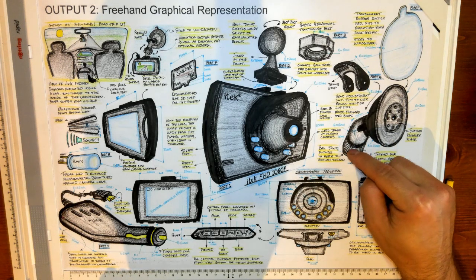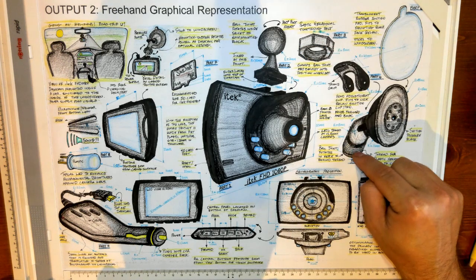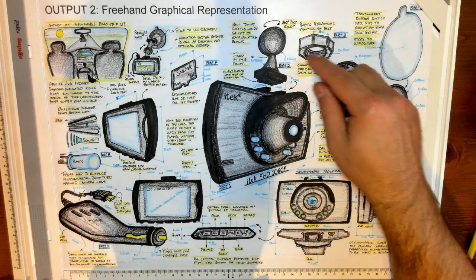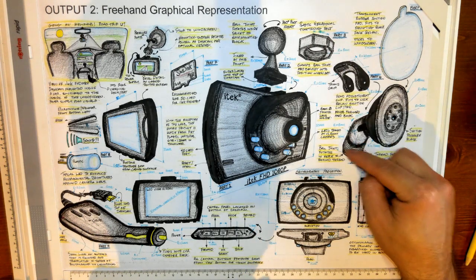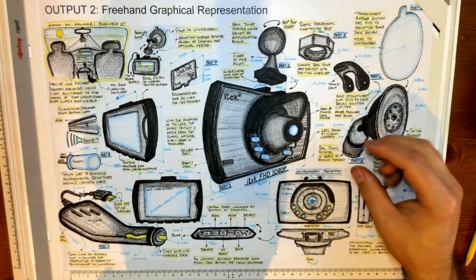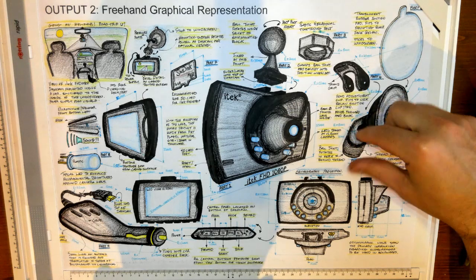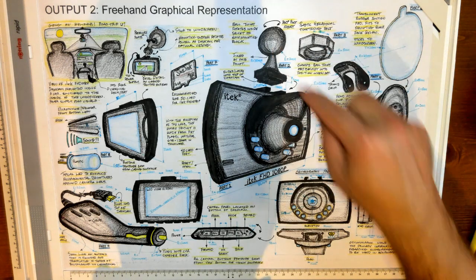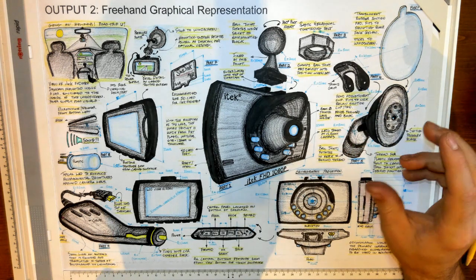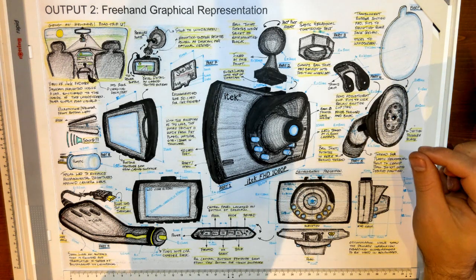You can see the thread here — what role does it play? Well, this bolt that I've drawn out actually spins onto this thread. When you move the socket and ball, you loosen the thread on the bolt until the bolt moves up. It's a plastic hexagonal tightening bolt. When you move that up, it releases the pressure on the plastic, allowing you to move the ball more freely inside. As you twist it back around, it tightens the plastic around the ball and locks the ball and socket joint in position. Once you have a set position, you spin the bolt down and it tightens everything up.